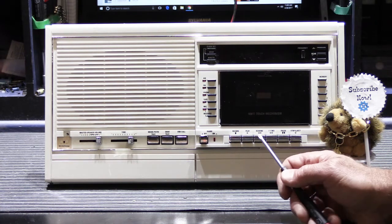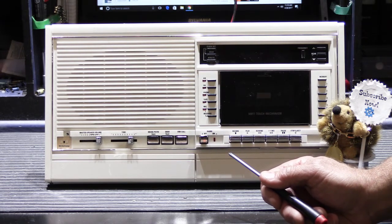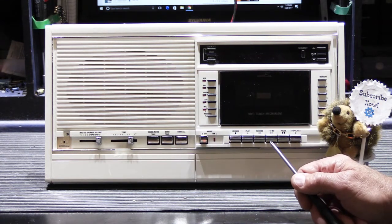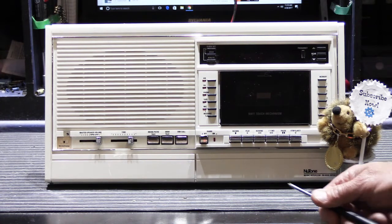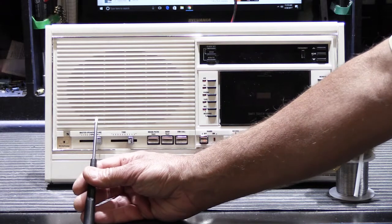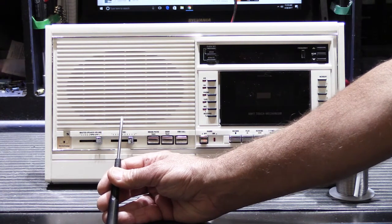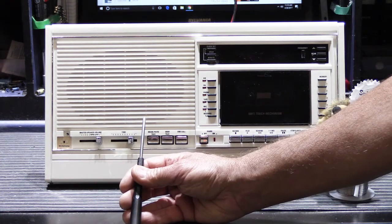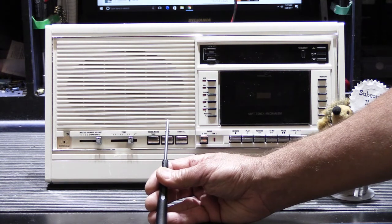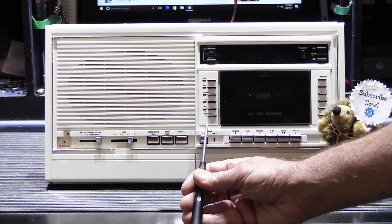The way this typically occurs, it's almost always one of two ways. When this was installed 27 years ago, the moment it was connected to power, all the components in the set started to age, and there are certain types of components that have lifespans. When they reach the end of their lifespan the failure accelerates. In a model like the 4006, one way is you'll notice there's a little more background hum than you previously had, and then over a really long period of time — could be months, could be a year or more — the hum will become louder and louder as more components fail, and at some point the hum will turn into a buzz, and the buzz will get louder and louder.